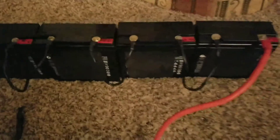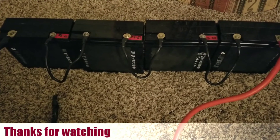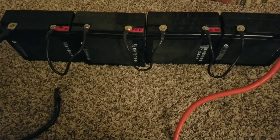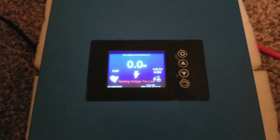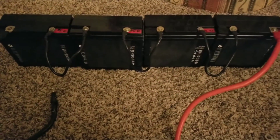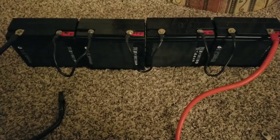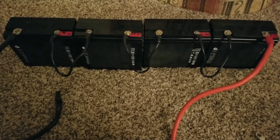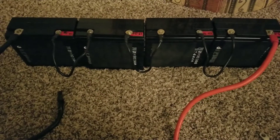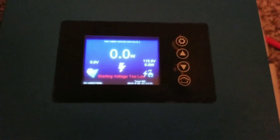Right here I have four 12-volt batteries wired in series to give 48 volts, 22 amp-hours each. As you guys know, this inverter operates from 22 volts to 60 volts. I'm going to use these batteries to represent the DC source — essentially demonstrating the battery backup system. This is what the video is all about, because this subscriber wanted to know how this thing works.